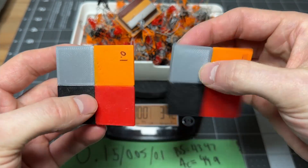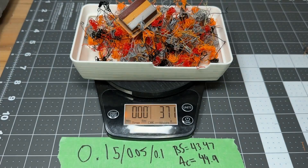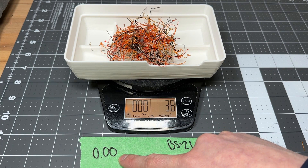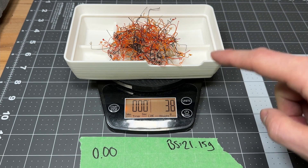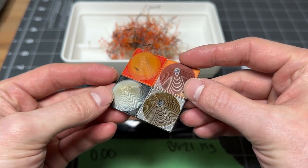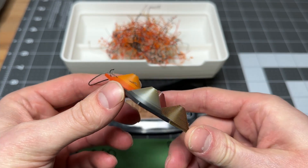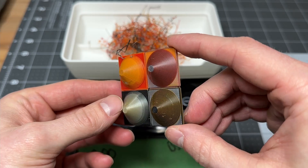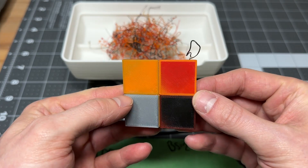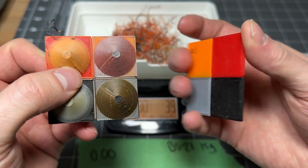Let me know what you think in the comments below. That brings us to one of our last tests: the 0.00 flushing multiplier. We have 3.8 grams on the scale of wasted filament, but the results are definitely lackluster to say the least — you just have a ton of bleed and just wrong colors entirely. Makes for a pretty funky effect compared to the 0.1, so really a huge difference in quality.